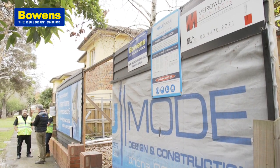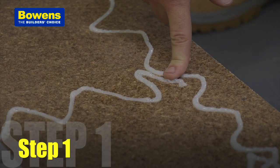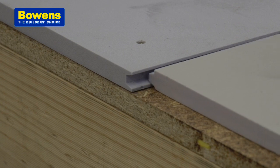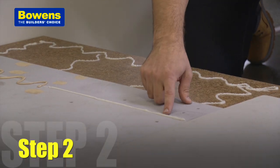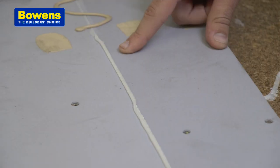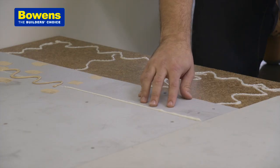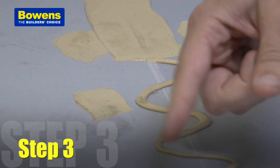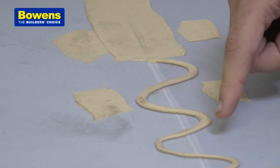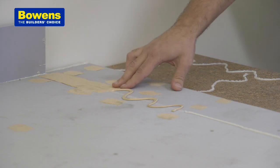With the system we've got here, we're applying our polyurethane adhesive at 200mm centres and then simply installing the Multi-Panel onto that. We fix it down and then apply the polyurethane adhesive in the tongue and groove — as you can see it foams and expands and fills the void. That join is completely waterproof. The final step is applying a polyurethane sealant adhesive over the sheet join and any penetrations, and blading off over that sheet join.